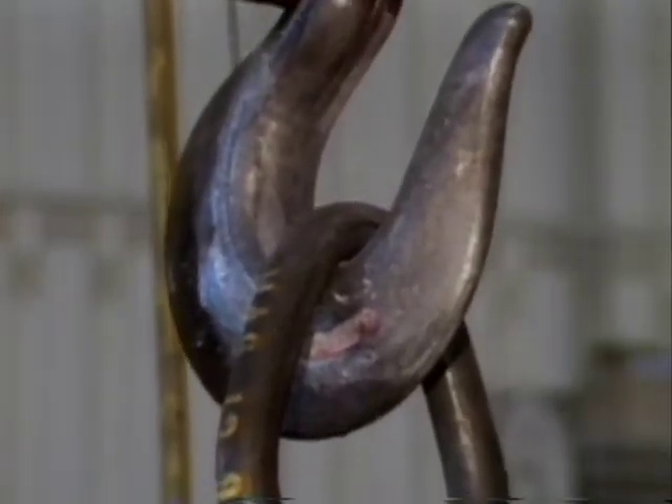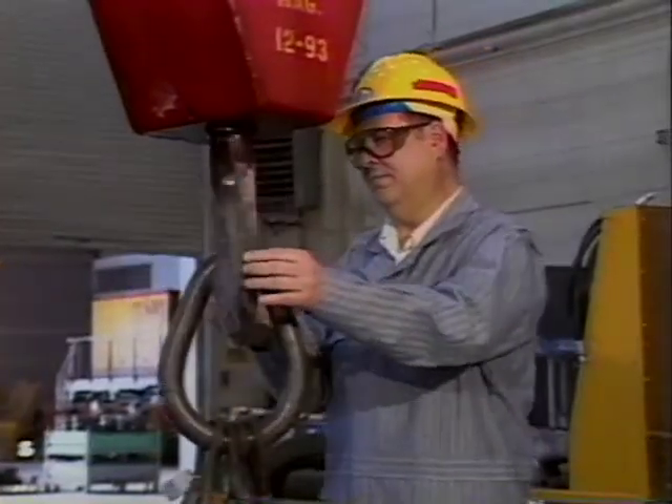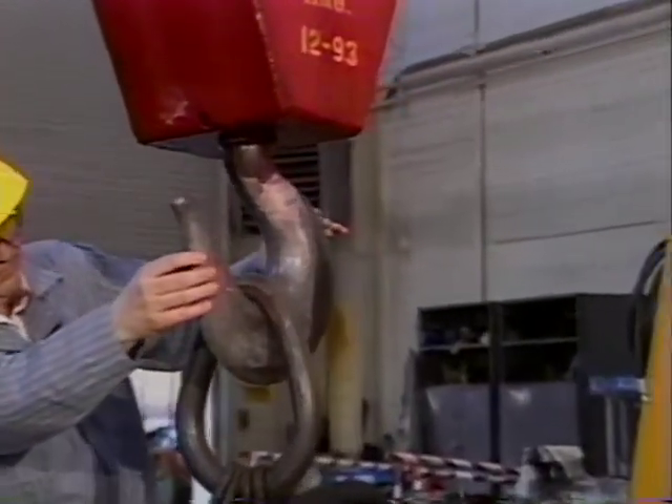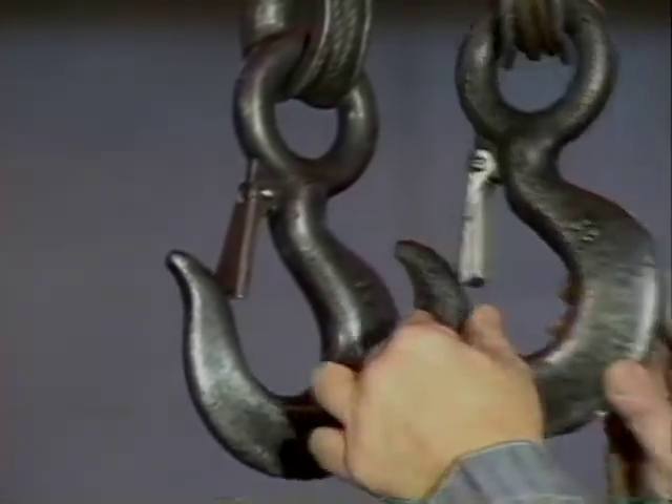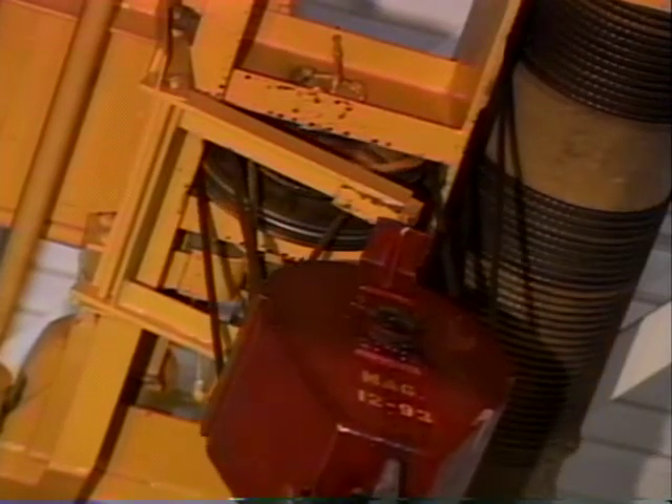Run the hoist rope out enough to see if there is any visible damage, paying special attention to parts of the cable or rope that get extra wear. Check hooks and latches for cracks, distortions, or corrosion, and make sure that the hook swivels on the block. Also make sure the safety latches are working properly on hooks and items that were originally equipped with latches. Inspect the wire rope and reeving system and the directional markings on the controller and the crane. One of the most important checks is to make sure that the hoist upper limit switch is working correctly. Inch the block into the limit to be sure that the switch will stop the hoist block when it reaches the upper limit. Then do a second check by running the block into the limit at a slow speed. The hoist should stop moving up and shut itself off after making contact with the switch. The limit switch is only a safety device and should not be used to brake during normal operations.